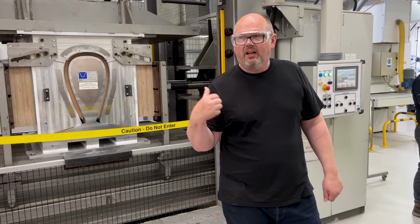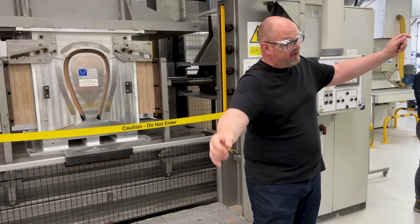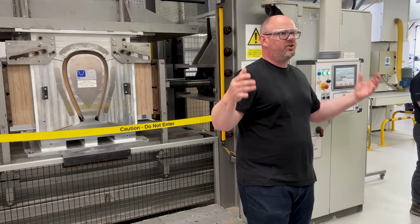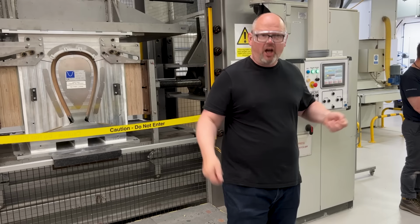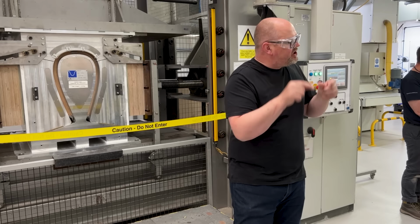So what we do is allow the tolerance in the wood, the excess in the wood, to give us enough float in the process so that they can centre it up by eye and get out again, which is obviously much healthier for them. There will be, when that emerges, a significant amount of excess which we machine away, and at that point we go from by eye to sub-millimeter measures of precision. The excess wood, of course, is recycled, so it's not wasted. Nonetheless, it's a more safe and efficient way of working, okay?